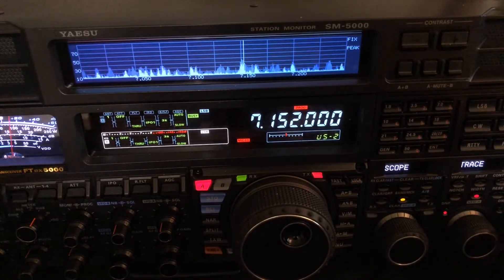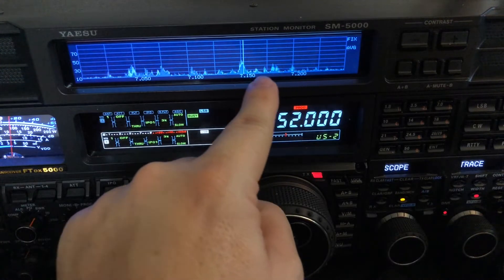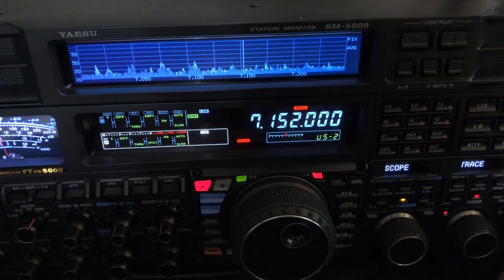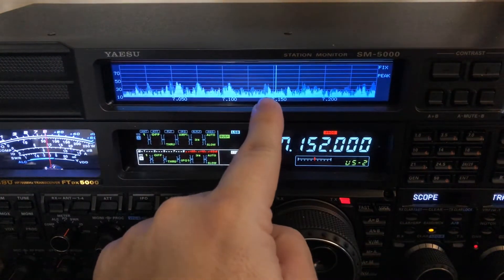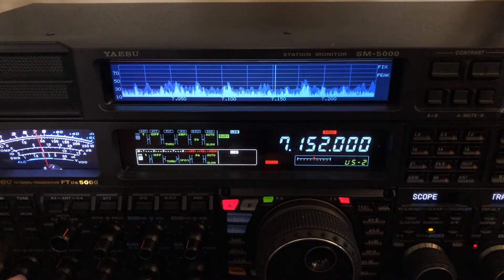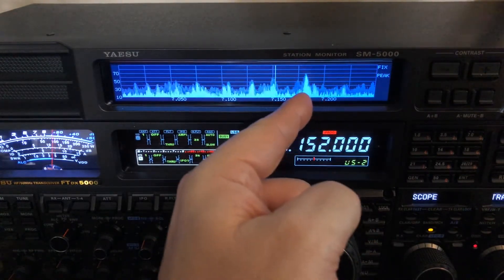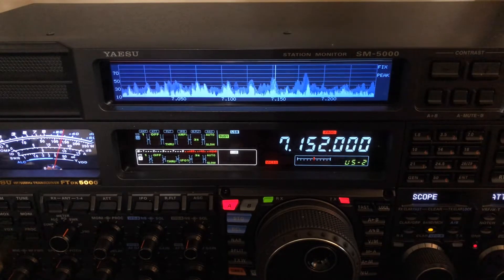I'll give you a quick rundown. Average is just an average of signals and noise floor. If I go to AMP1, you'll see a lot more averaging with the noise floor riding across the bottom — I don't care for that mode. What I do like is peak hold. In peak hold, where there was a signal earlier and it drops out, it'll hold a little gray marker. So imagine a quiet band like 17 meters with only two signals poking above the noise — if you see a spike and the station quits transmitting, peak hold holds that gray marker so you know where he was.